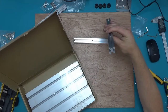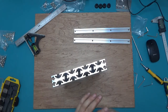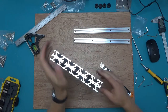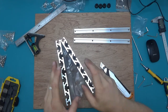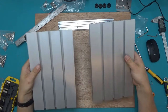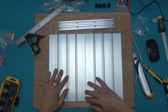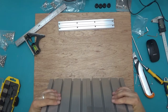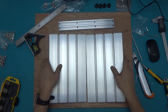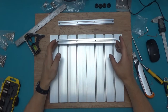Here is the bed assembly: two 20x20mm extrusions and the bed itself, which consists of two 15mm thick plates with protective film. Those are two identical profiles meant to go together like this — you're missing a groove in the middle on the top side. This is meant to be the top, and the bottom side, which we'll be working on now, will be missing that groove, which is confirmed by the holes in those extrusions.